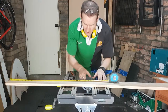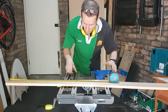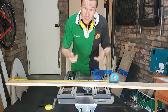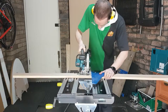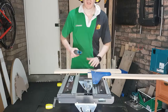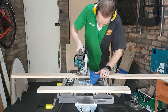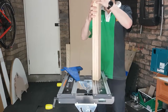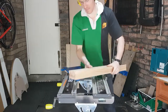First thing, I need four 29-inch or 734mm sections. This is my 90mm by 19mm board. I'm just going to be using the square cut to get those out. Obviously a mitre saw or a table saw is better, but a circular saw is going to have to do it. Didn't measure that one very well. I need to work on my accuracy and stop going so fast. I blame me, not the tools.